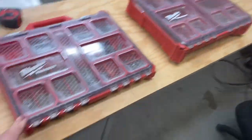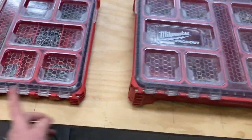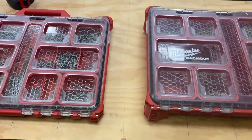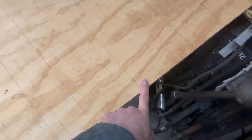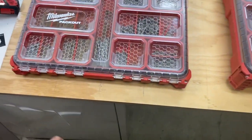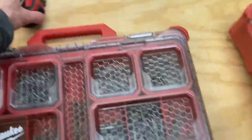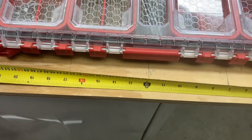I've decided to use an eight-foot-long piece of plywood and have four boxes evenly spaced out. Dividing that eight-foot sheet into two-foot pieces — that's also the frame of the trailer — so the screws will go there according to those 24-inch centers. I then divided those 24-inch centers in half to find the centerline of each box, so there's 12 inches, and I made a mark there.